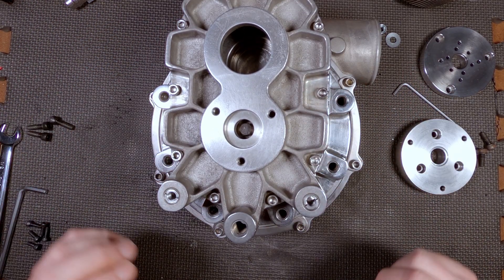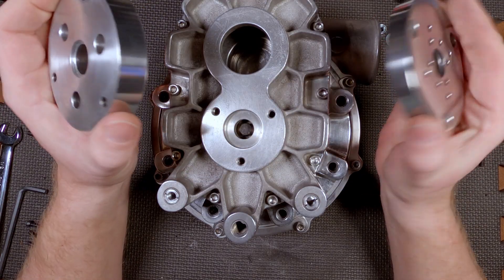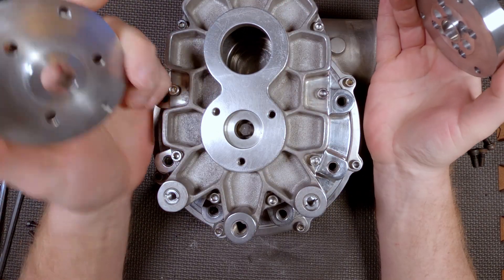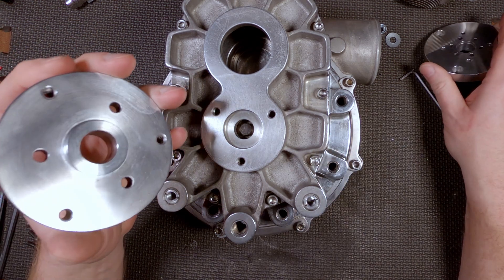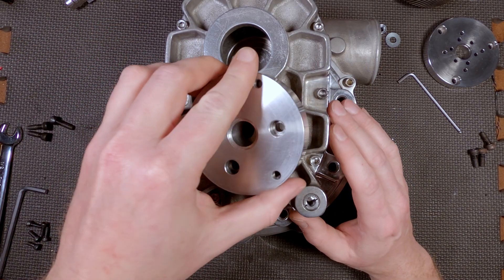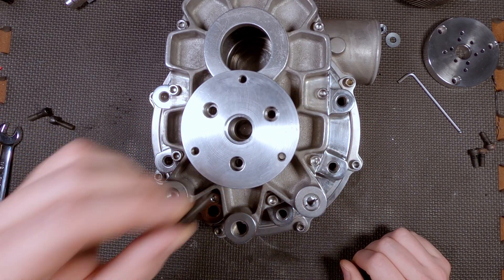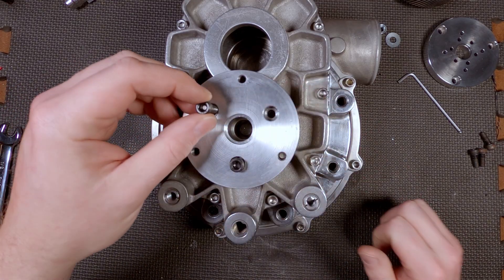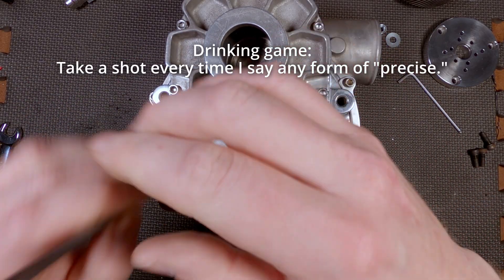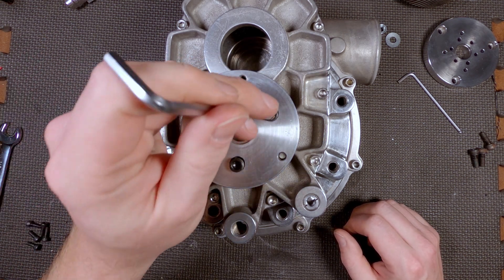Let's put this thing together so you can see how it's assembled. You have a stack of these aluminum discs. This is the motor mount plate, and it's got bolt patterns for the TP power motor and now for the LMT motor. And this is the adapter plate. It all fits together very, very precisely. This is all machined as accurately as I can. This just slips in here - there's no play in it at all. The mounting holes are pretty well made. It takes a while to be this precise, particularly if you're not a machinist like me and don't have the greatest tooling in the world. You do the best you can, and you can do some pretty precise work assuming you're careful.